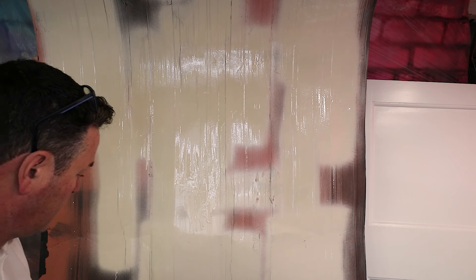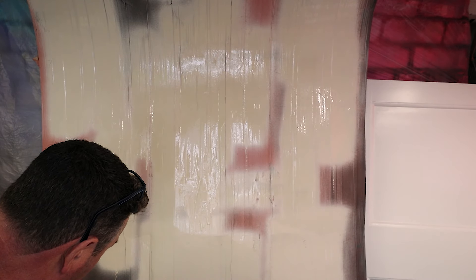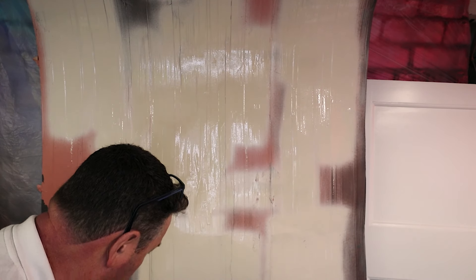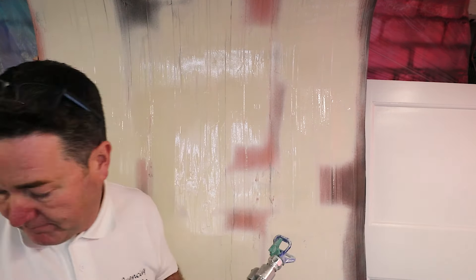I'm back. I've just swapped it over. I've put it on to full flow - that regulating knob at the end is on full, open out. So this will react like using your full gun; you're not restricting it. For the purpose of the video, no mask. I'm just going to do it on the side, turning my gun that way around. I'm going to hold it about 12 inches again. Can you see that tail? There's that tail there.